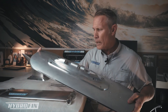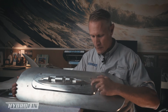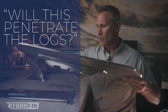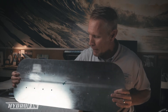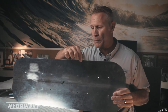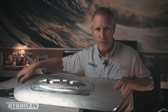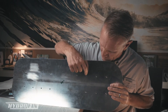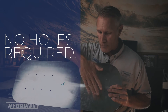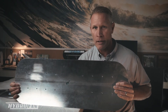One common question about this plate is whether these screws penetrate the pontoon logs. I'll flip this over to show you: the screws are half-inch screws, the first plate is a quarter-inch thick aircraft-grade aluminum, and so is the second plate — giving a total thread depth of a half inch. As you can see, they do not actually touch the hull of the boat. And of course you've got the Lord structural adhesive as well, so you don't have to worry about any leakage on your boat.